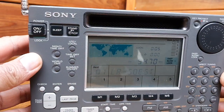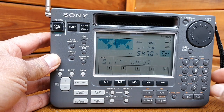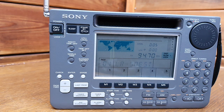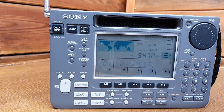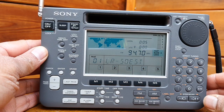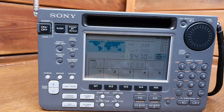You can see there is audio but it is very weak. You can see the signal strength is good, but the audio is so faint. So this is one of the symptoms of a radio suffering from bad SMD electrolytic capacitors - when they dry out. The solution is to replace them and the radio will be serviceable for another 20 to 30 years, working absolutely fine. All other components are fine; only the capacitors need replacing.